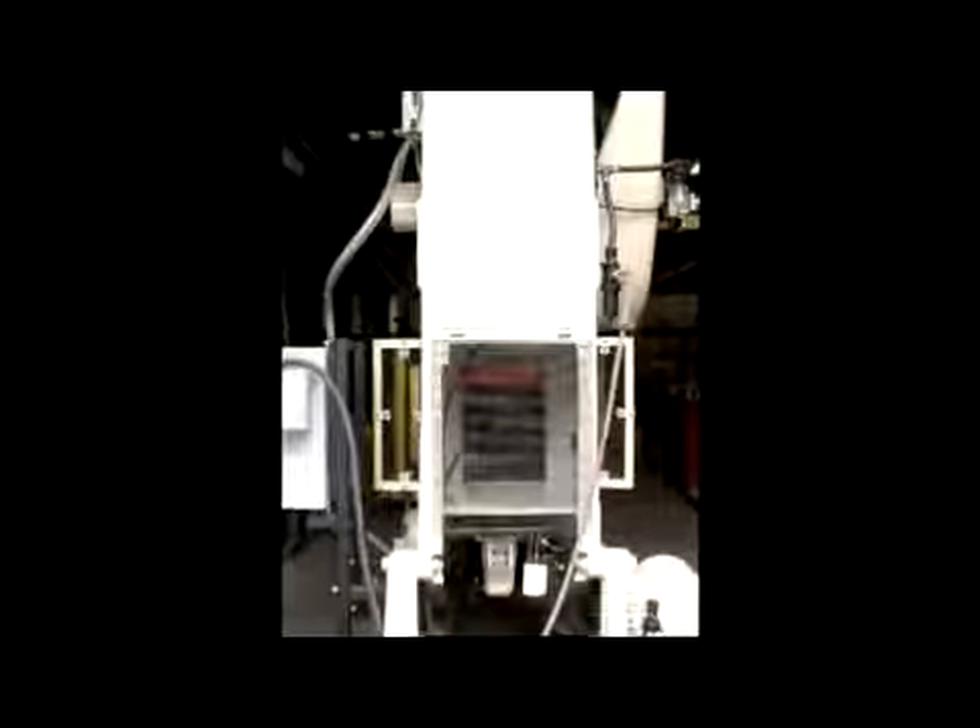It meets all current applicable regulatory standards. Number two: safety. The light curtain will ensure that the operator's hands, as well as other bystanders, are always kept out of the danger zone. The light curtain must be inherently fail-safe in design. Number three: ergonomics. Conventional presses use two anti-tie-down palm buttons, forcing the operators to press hard on the buttons, which sometimes inflict the operators with carpal tunnel syndrome. The Swift Trip sensor is conveniently placed in the path of the normal motion of the hand of the operator and only requires a gentle touch to cycle the press.